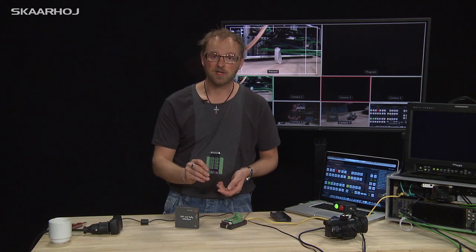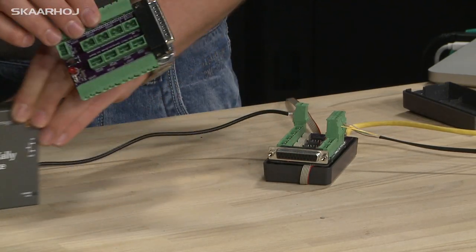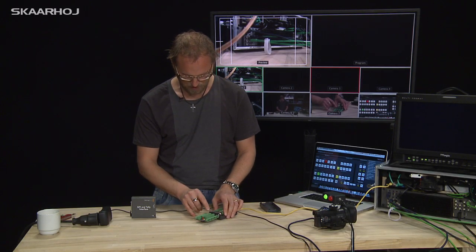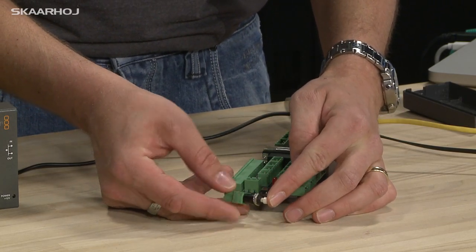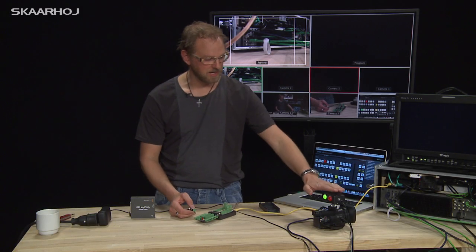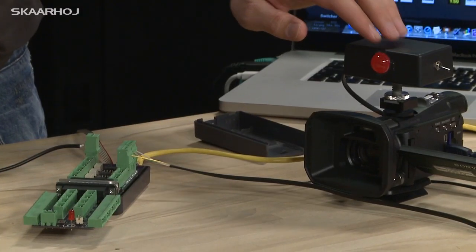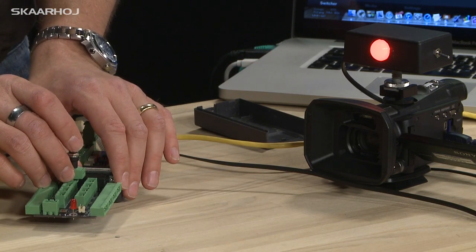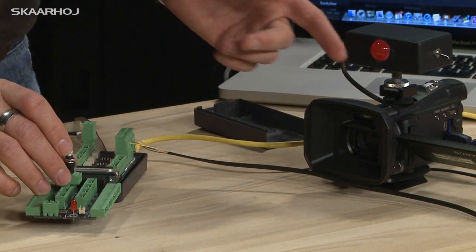In order to demonstrate that, I'll use another product — a breakout board that is compatible with the connector on both of these boxes. I'll use it because I have no Phoenix connectors for my inputs, so when I connect this, I now have Phoenix connectors for all the inputs. Then I have this tiny little push button which I connect to one of the GPI inputs. That will allow me to switch my camera over here to program. So we can see the camera has the LED for program here — and when I press, the camera goes on program. Imagine that you wired up another button to input 2, and when you push that, input 2 goes to program.